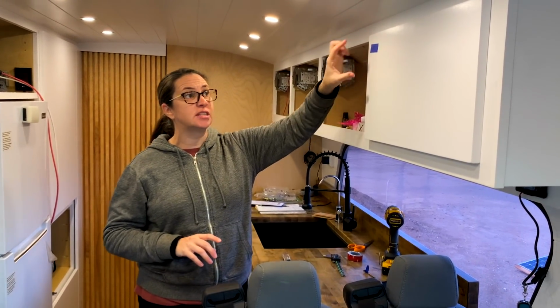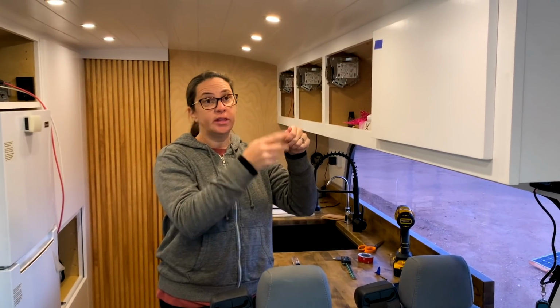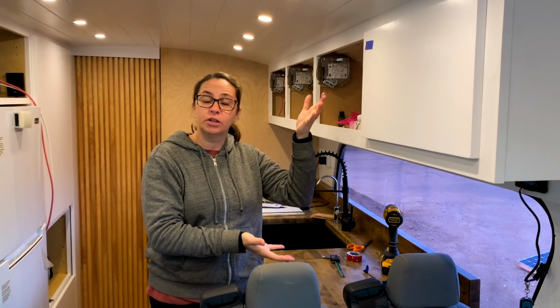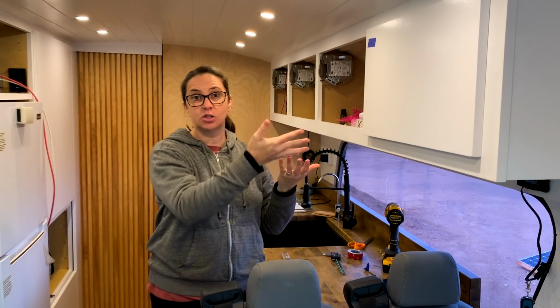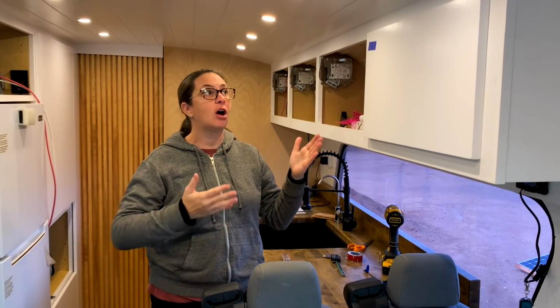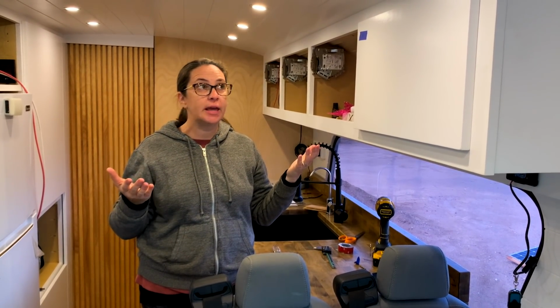So all that said, now we had to figure out how to actually attach the part of the hinges that go on the cabinet door. Now, as you know, with IKEA stuff, most of it's just plug and play. They're like, hey, these go in the 3rd hole and the 5th hole that are already conveniently pre-drilled for you, and you just stick them in and screw them in those particular holes. They don't give you any measurements. And obviously, because we're doing this a little differently with the face frames than IKEA cabinet fronts are made, we had to figure out our own measurements.